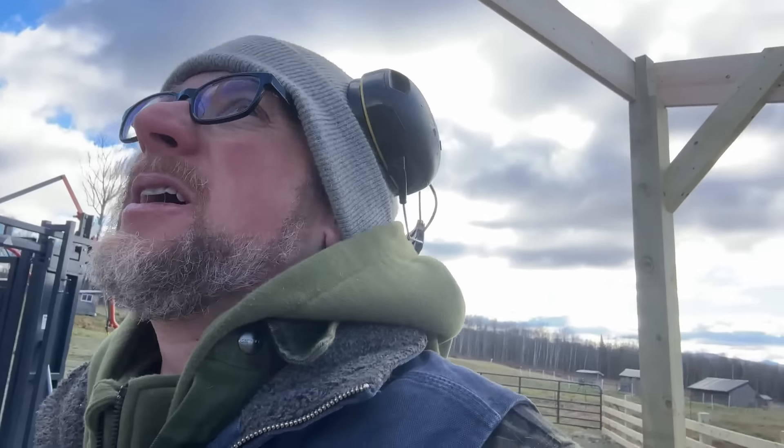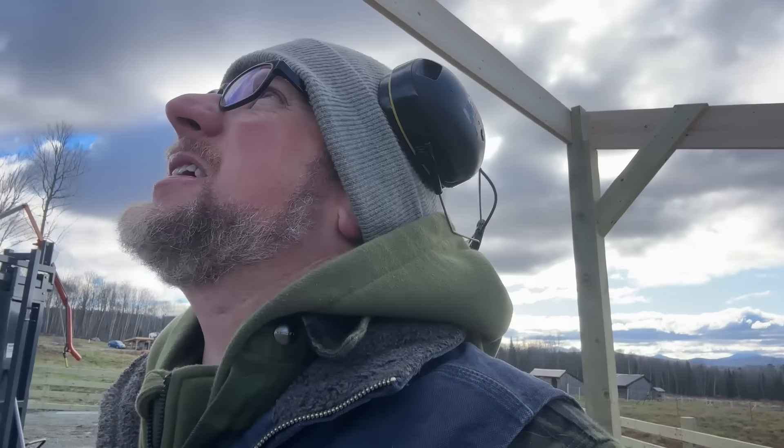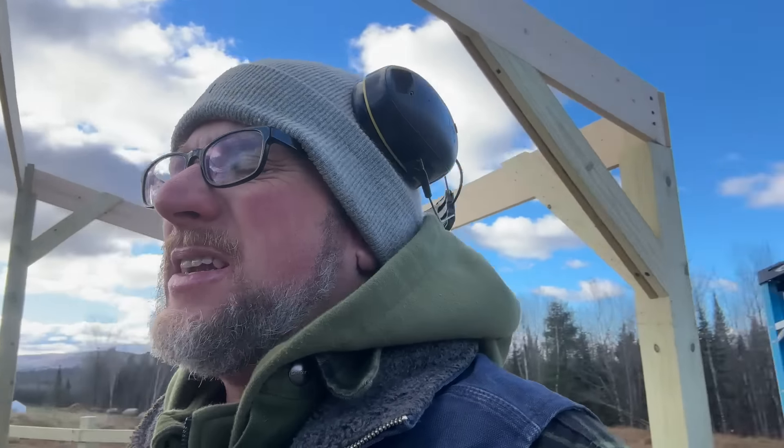We had some wind come in overnight that brought in the cold air — it's like 39 degrees out right now. It was 30 degrees first thing this morning. It is still windy, but the sun is coming out, so hopefully it's going to warm up and the wind dies down so we can get our rafters up. We've got to figure out our rafter length, and the biggest thing is to see what we have for leftover tin and what lengths we need. I would say at least ten feet — the measurement up above is like eight feet five inches, so we want at least a ten-foot overhang total. Let's go see what we have out back.